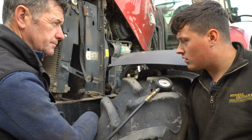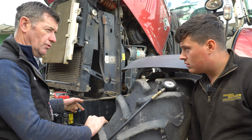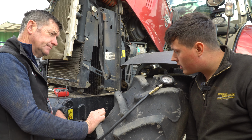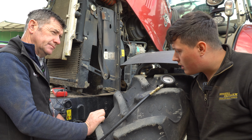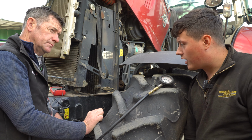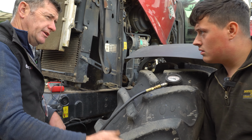So more or less the thing to do is bring it out and get a chopper on it now. The electrical end of it looks okay. I have the correct resistance on my solenoid, 10 ohms, and then my supply up to it. So that should be fine when it's running. We could have a different scenario, so you just have to make up a lead, then just check out your pressure.